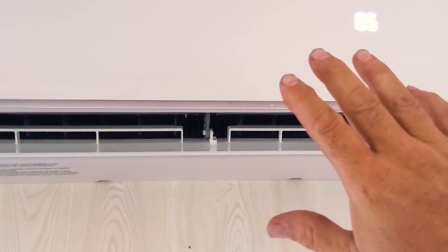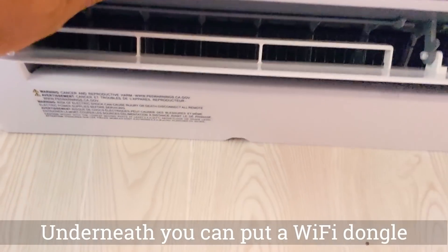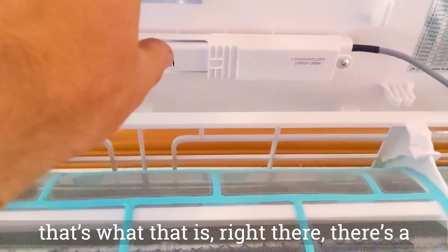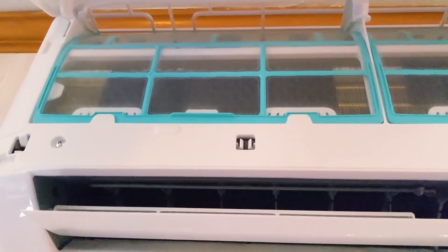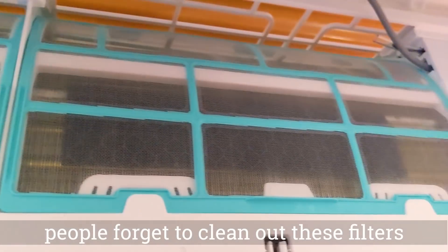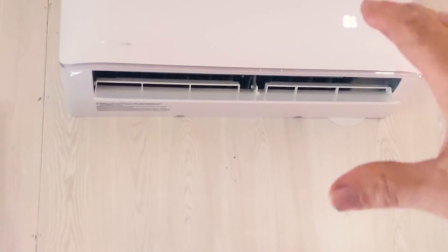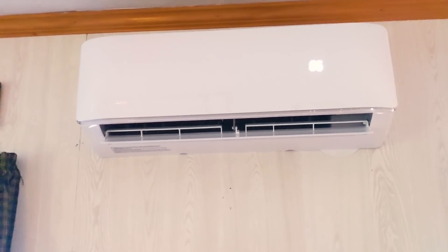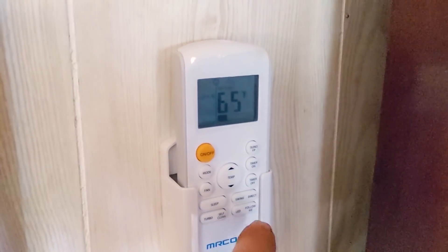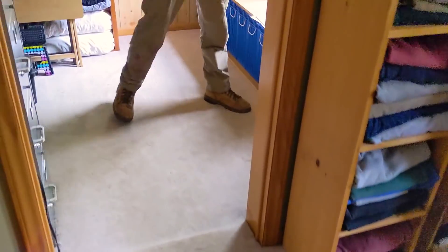The inside unit is installed — we're testing it. Can you feel 65°F? It was very hot today and this feels awesome. Underneath the unit you can plug in a Wi-Fi dongle — there's a Mr. Cool app and you can control it remotely over the internet. A lot of times people forget to vacuum out the filters, which are removable and cleanable — always pay attention to those. You can also set the louver swing on the remote. We keep the remote with the regular house remotes and you can put it on 'follow me' mode, where the unit works to satisfy the temperature wherever the remote is located.